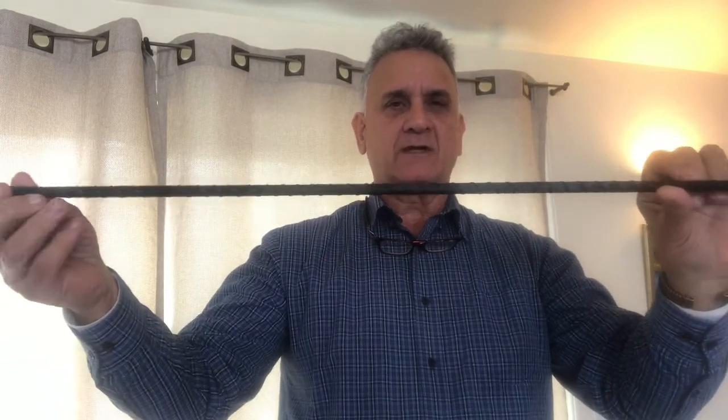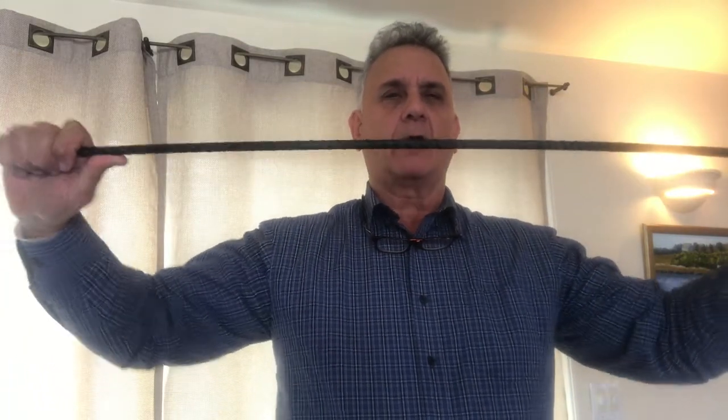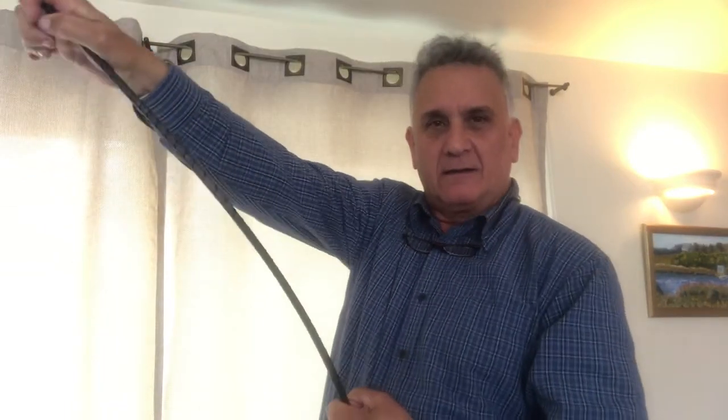From these fibers we can make all kinds of things. Starting with reinforcements for concrete — we actually make rebars like steel rebar, only over 70 percent lighter, two to three times stronger in tension, and they'll never corrode. The strength of this rebar is incredible, and it has a memory — it wants to come back to straight. As you can see, it snaps back.